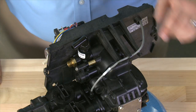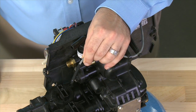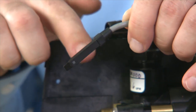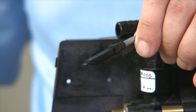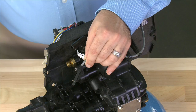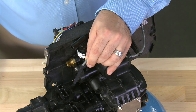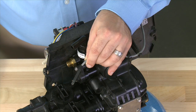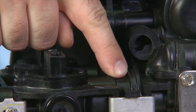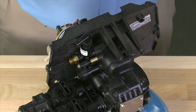As we move to the components on the valve, we start by following the cable over that goes to our turbine meter. We can pull this up from the cord. There is one flat side and the other sides are round. If we suspect a problem with the meter, we can run a magnet across the flat side — this should register flow on the control. If it does not register flow, we can look at replacing the cable. If it does register flow, we can look at repair or replacement of the turbine meter. As we untuck the cable, we can pull it forward in order to remove it from the assembly.